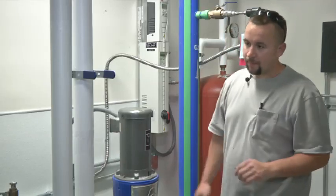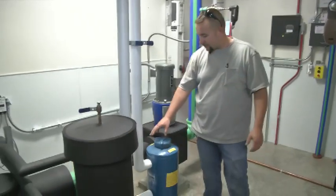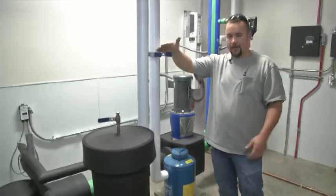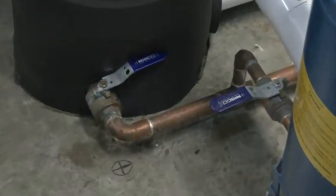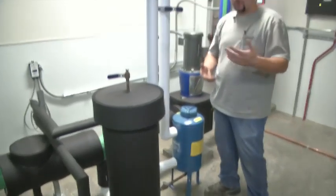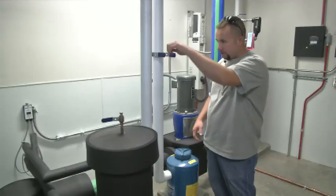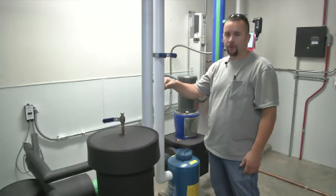This particular setup has a chemical feeder right here. You'll have somebody come out and test your water levels for whatever chemical you have in it, and this is where you add it. Shut off valves are here, so when you go to add chemical, valve these off and there is a drain — same deal as the filter downstairs. Open it to relieve pressure, take the lid off, add whatever you need, then when you open it back up, open one valve slowly to get that water level up to the top, put your lid back on, then open your other side — that way you're not introducing air into the system.